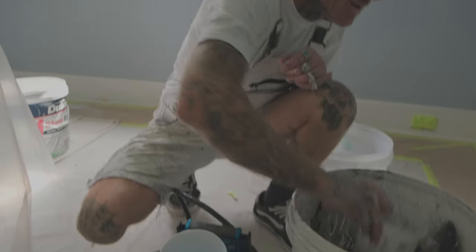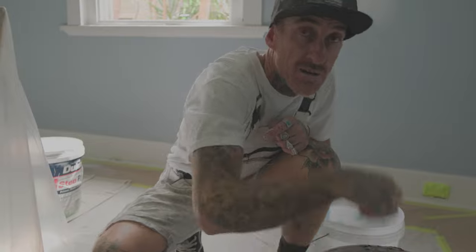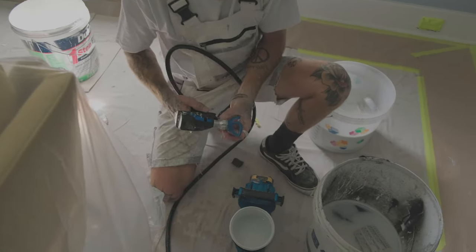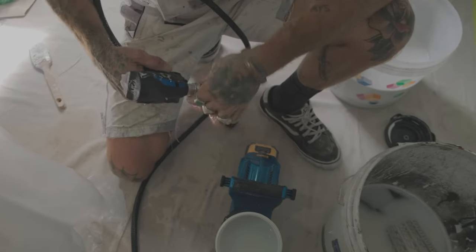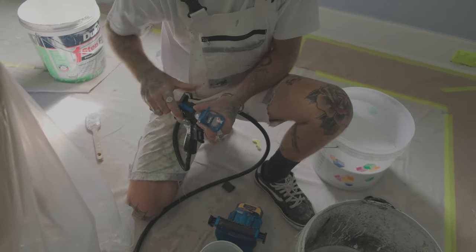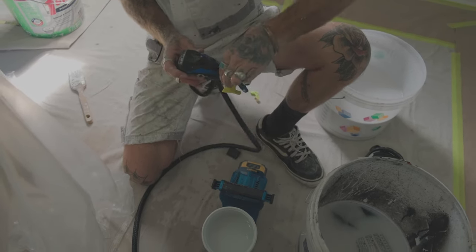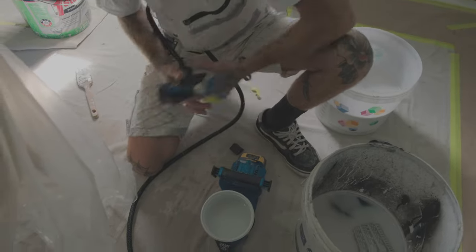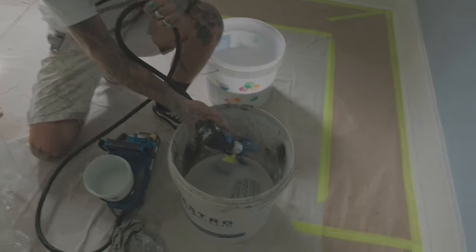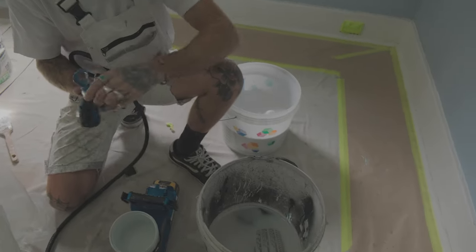So now we can start cleaning out our tips, because there's no point blowing your tips out if you're blowing them through paint or dirty water. Get out your tip guard and screw your tip guard back on. Don't tighten it all the way up because it puts a lot of pressure on your tip - you don't want to force it in there, just want it to go in nice. Tighten it up by hand. Flick it over, make sure it's on prime, then switch it over - nice clean tip now. Put that in your fresh drum of water.